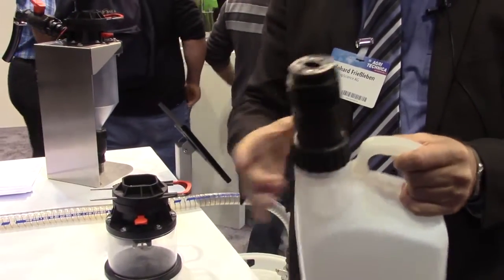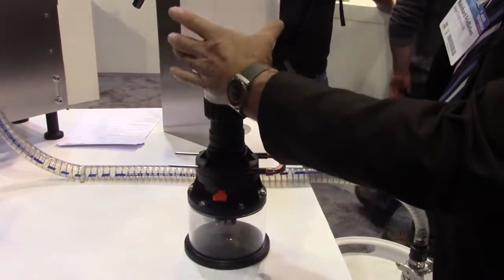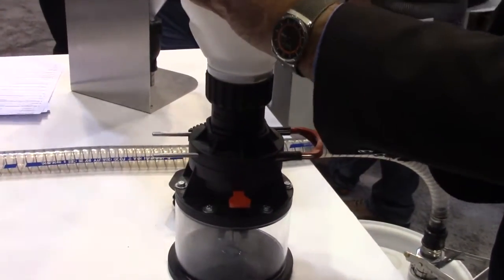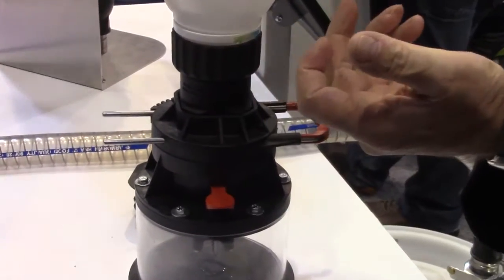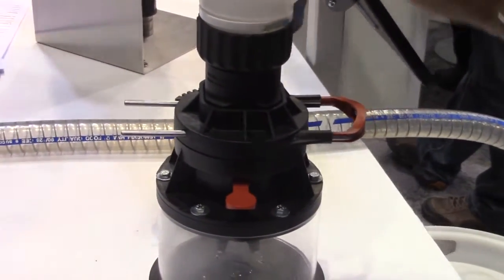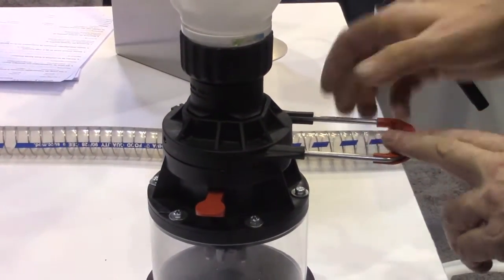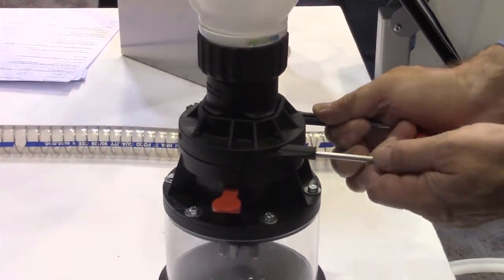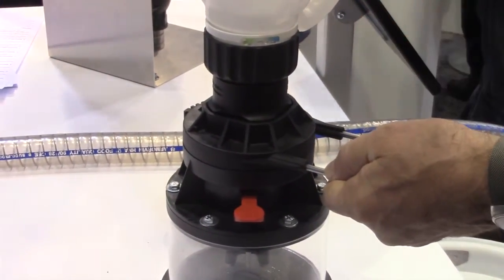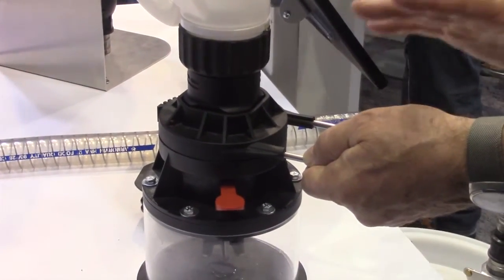You see, we screw it on. And whilst connecting this canister adapter with the tank adapter and pushing down, we cut a seal. This seal stays to 20% still on the container. We connect both, and now we are able, whilst turning this element, to open a valve and the product from the canister drains into the tank without any contamination.